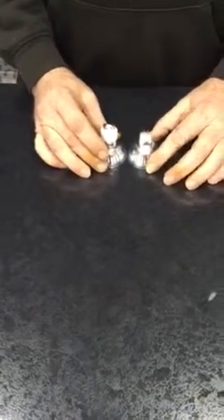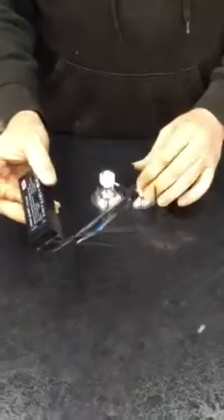The difference between MR16 and GU10 is that MR16s are extra low voltage — they run on a 12-volt transformer. Normally those transformers go inside your ceiling space, and then they connect to your MR16 lamp holder.